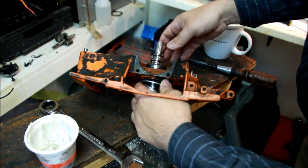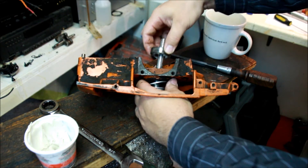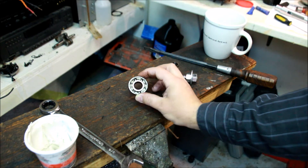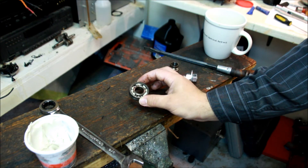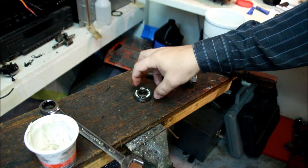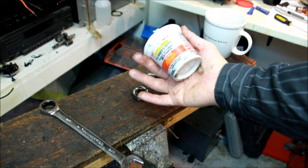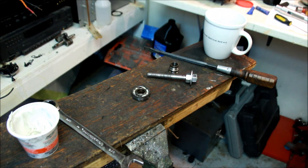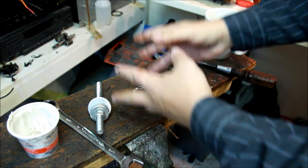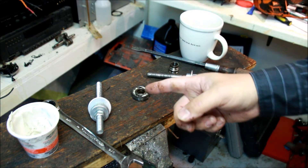Let's look at it. See how we did. A couple of spacers — these are just old inner races. Here's the bearing. So as long as those balls are fairly equidistant from each other, it doesn't matter how well or poorly they're held — they will still hold the inner race to the outer race, and you'll be able to press that out. With just some good old fashioned plumber's putty. I thought I'd quick steel it, super glue, something — nope, no need. Just good old plumber's putty is fine. That's how you cold press a bearing out that was buggered — with plumber's putty. Thanks for watching. Don't forget to subscribe.